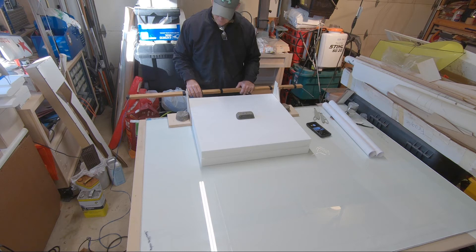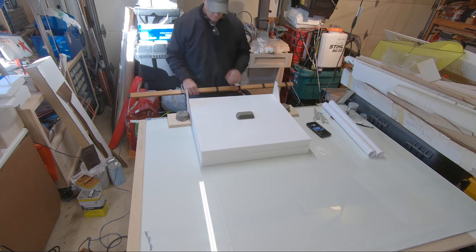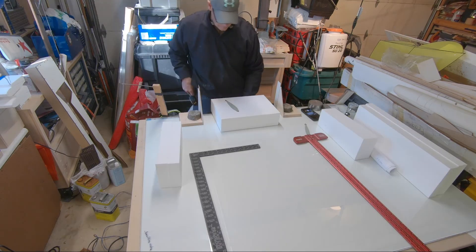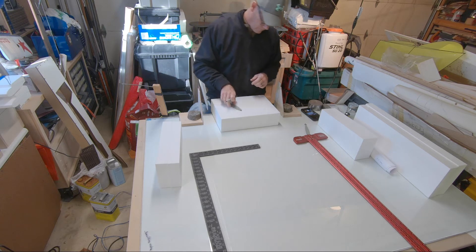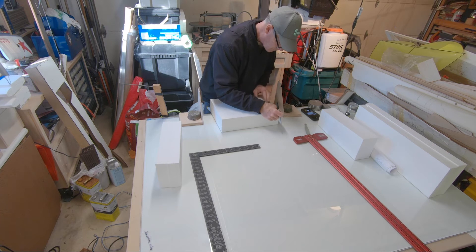It's the same with the wire that I stretched across the glass — it's on a variac. I'm cutting this probably at about 60 volts AC, which is the upper limit. I've got a switch on the bow so I can click it off really quick. And then I just go around the blanks and get the top plan view of both wings into one block.